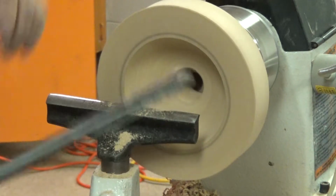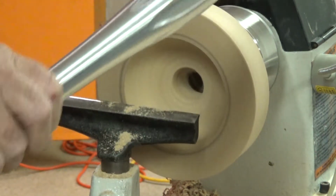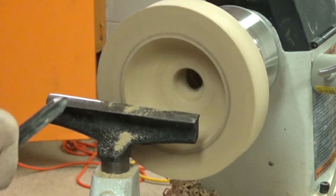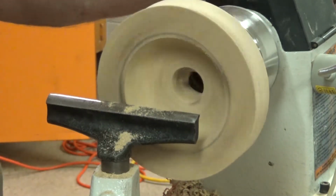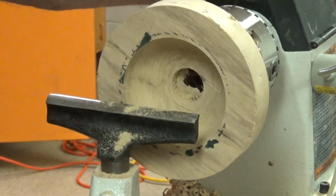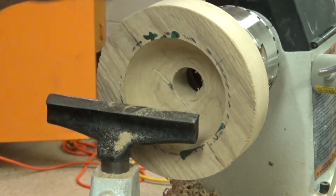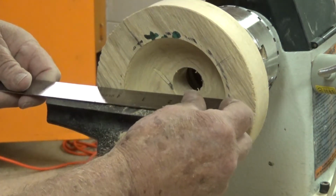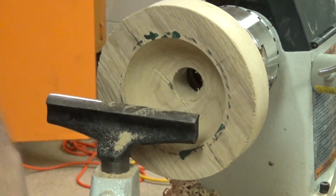So I tried to slow what I like to call my feed speed down. That kind of allows me to make a smoother cut, and it shouldn't have that much tear out in it now on the inside edge here. And it doesn't, surprisingly. All right? Kind of got a little sparkling going on in there. So pretty sure that I've got to go bigger, and I'm not quite 4 inches yet. We're going to take another pretty good pass out of there.